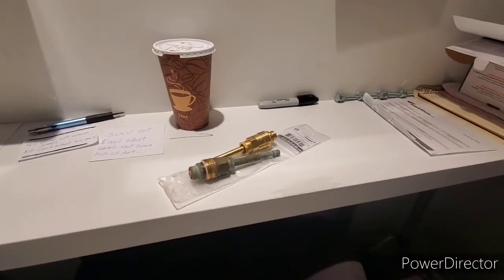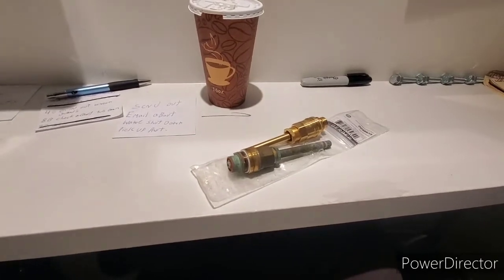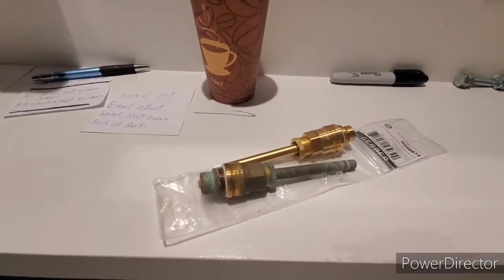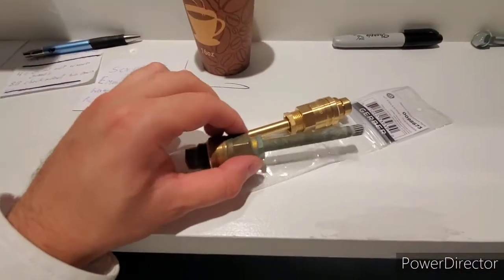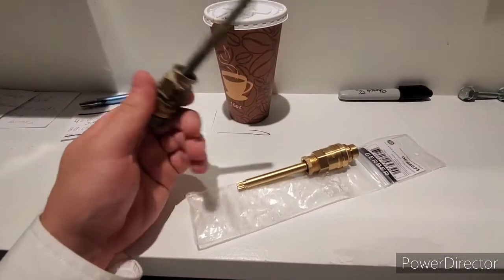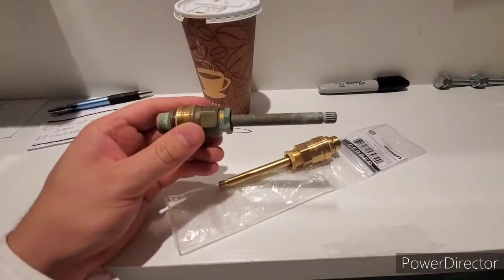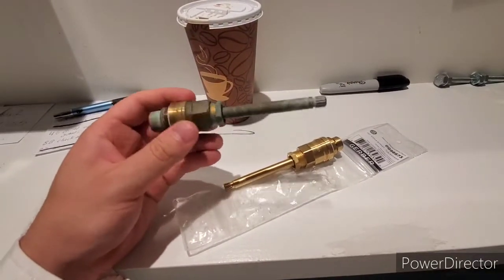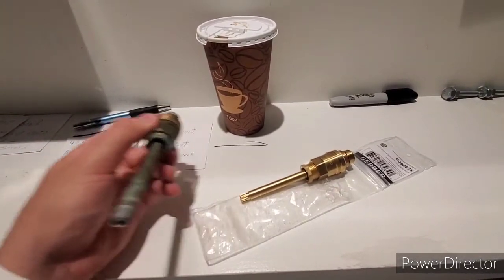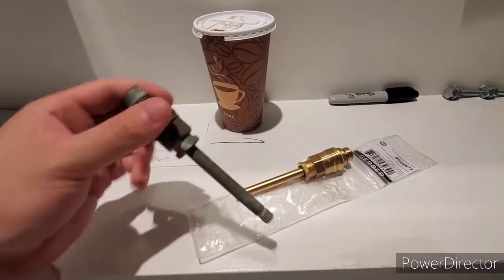Tomorrow you're gonna see the first video of a shutdown and how I shut down a riser. One of these is leaking in the wall. These are Gerber shower stem valves — you always see these in the shower, the three-handle valve. But in this building I also use these as the branch valves in the bathroom, under the sink for hot and cold. If you shut one off, it shuts water off for the whole bathroom: sink, toilet, and tub.